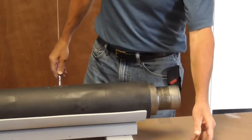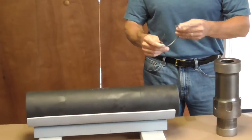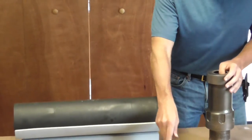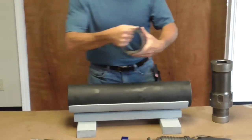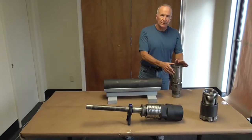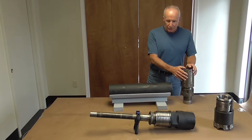I can feel the ring move — it moved a little bit at a time. There you go — there's the ring, the piston's popped it out. The ring is actually pretty durable. When you get it out, check it to make sure the ends aren't broken off or cracked, but usually they're pretty durable. A little bit later we're going to go into the inspection of the piston and the cylinder, where I'll show you where these parts need to be measured to make sure they're all within spec and let you know what parts should be replaced if the hammer starts to lose power.